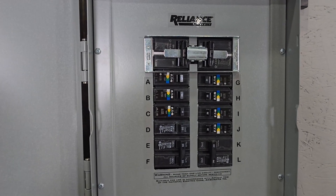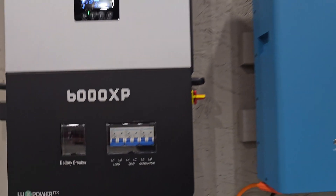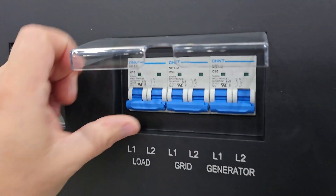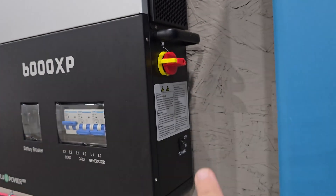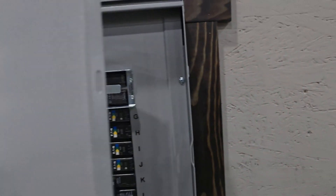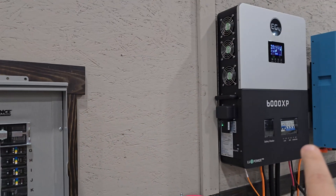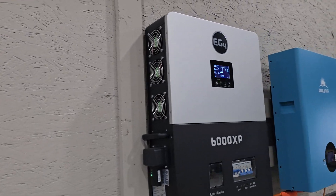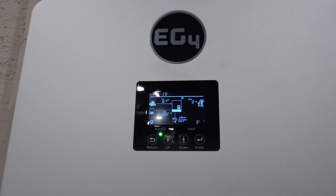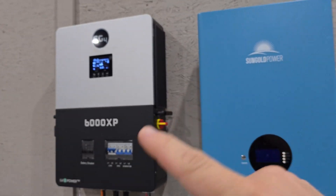Now you should be able to turn on your critical load center and back it up using your inverter and battery. The fans have kicked on because we're charging the battery. We'll turn on the load center. We have solar coming in, the inverter turned on, the load center turned on, the battery turned on, and EPS turned on. In the critical load center, we'll switch from utility to generator — this is our backup. We switched it over and didn't even get a flicker. Now we're powering with PV first, battery second, and any leftover PV is charging the battery.